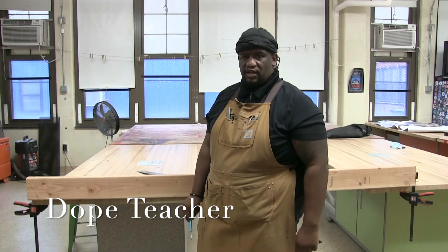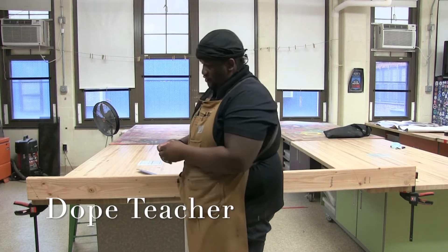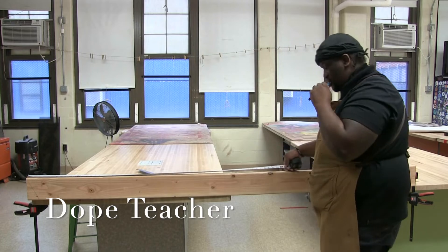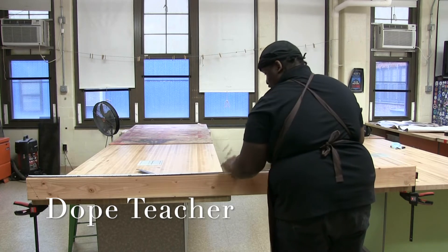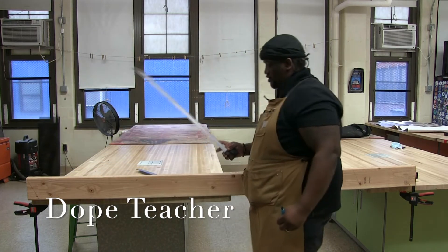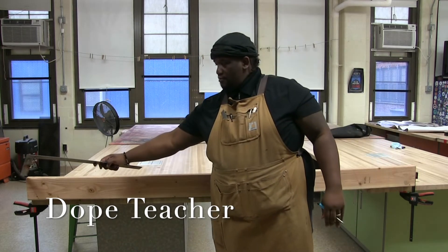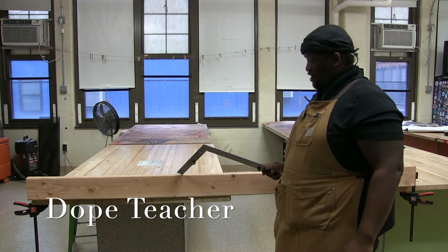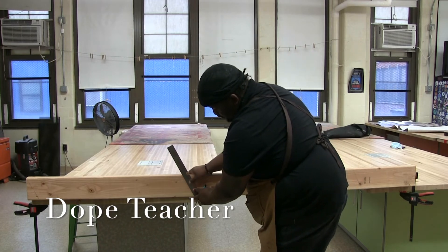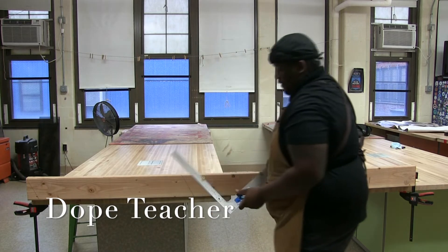Let's just say they want a rafter that is 48 inches with an overhang of 4 inches. So what we're going to do is from the corner right here, let's measure 48 inches. We're going to do 3 inches — mark right here. Now, from the ridge beam to right here, that's going to be 3 feet, 36 inches. First thing you want to do is draw a line.